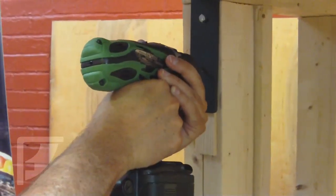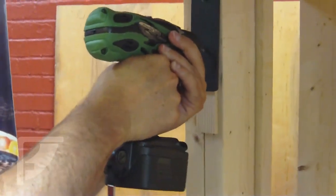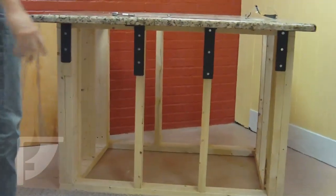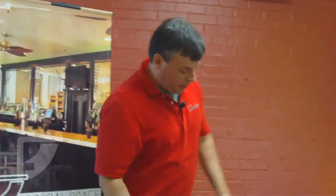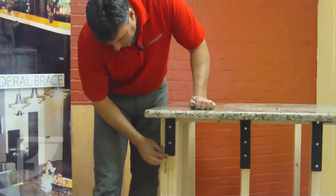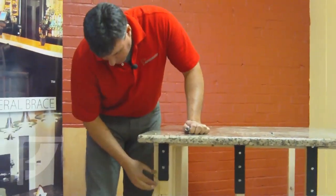I'm going to come back over with my drill and drill through my shim. So we've got our countertop supported here. We are ready now to finish off our counter. Earlier I was mentioning that we had a quarter inch thick bracket material, and we have a quarter inch standoff from our hex head bolts. So what you're going to need to do is when you're fastening your fascia on — depending on what you're using, paneling, sheetrock, whatever you're going to be putting over the top — you're going to need to fur out this board, your substructure, in order to put that fascia over the top of it. We'll show you how to do that as well.